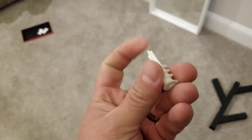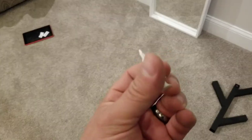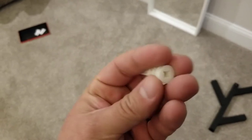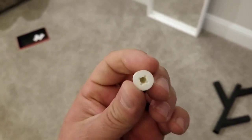Don't just tap them into the wall with a hammer. Actually screw them in, because it bores a hole and then it goes in tight and creates almost like a seal and pulls the sheetrock. When you tap these in you actually blow out the back and then these will start to spin. Believe me, I know.